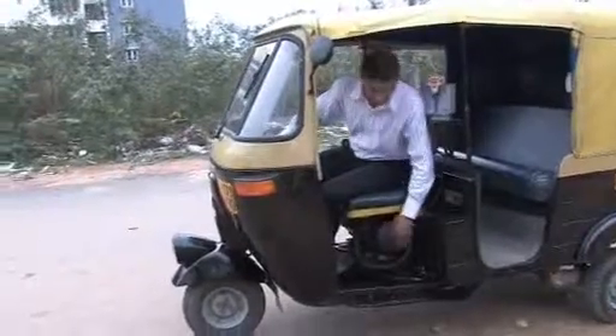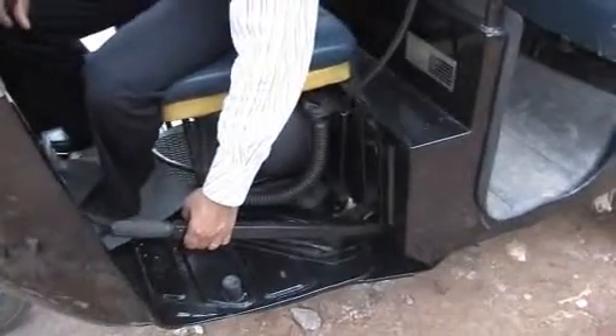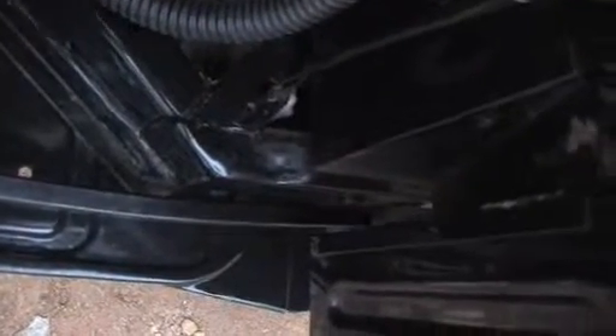It's an area that nobody has to ever look at again. The next application is on the hand starter. We do have a starter motor, but sometimes, should the starter motor not function, the hand starter comes into play. Inside there is an iglidur bush which is used to safeguard the smooth motion of the hand starter. As you can see, it's a long lever and a lot of forces are being transferred by a single bush.